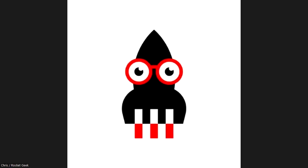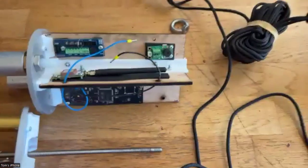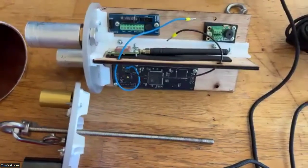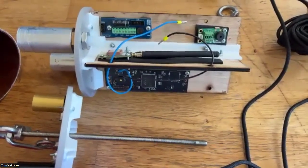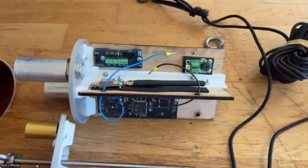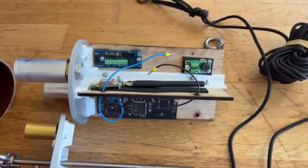Yeah. Okay. What about your switches? How are you turning these things on and off? Mechanical arming screw switches, which will be mounted on the edge of each bulkhead and screwed effectively to turn them on and off. And they won't line up with the rail either. Better on that. Okay, good. And again, reiterating my comment about making sure that where you have to access those screw switches is definitely on the opposite side from where your rail buttons are. Yeah. Okay.